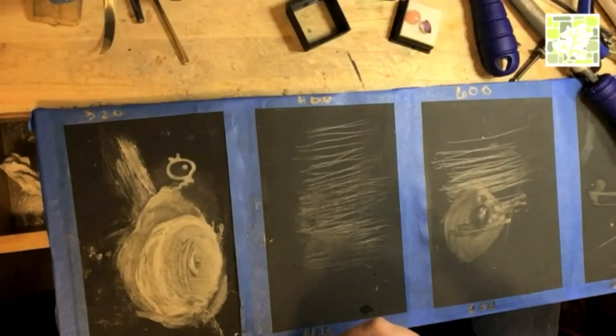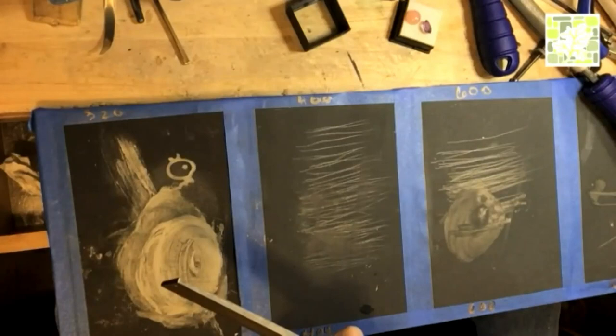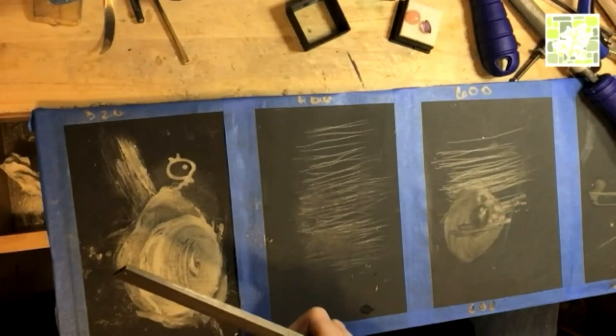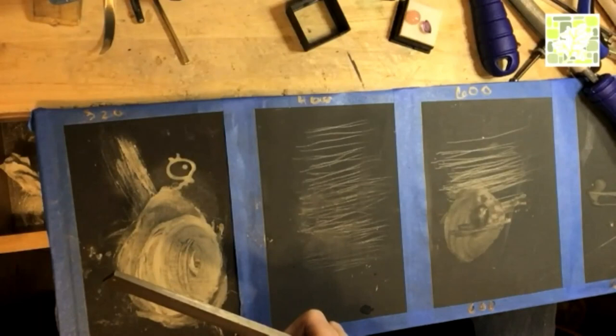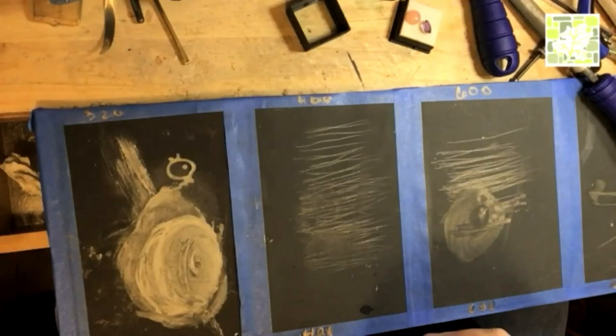Yeah. So the biggest challenge I've seen, I have had students who've had MS, and so they have a sort of semi-permanent palsy. The best thing that I've found is turn the torch off, put it down, use a paste solder in particular, which acts as a glue. So you put your flux down and then heat it a little bit so it gets crispy, then turn your torch off, position things in your own time, pick solder, whether it's a pick or a pair of tweezers, whatever works for you, and move it around until it's where you want it, and then scooch back in with the torch. So it's about pausing to position things. Great, that's a great idea, paste solder. Good. So paste solder as an option, certainly.